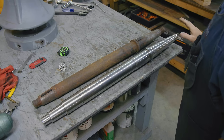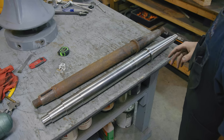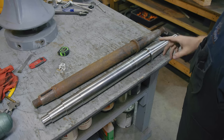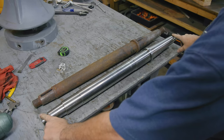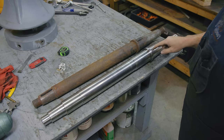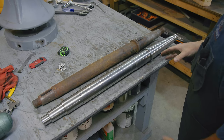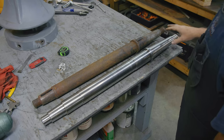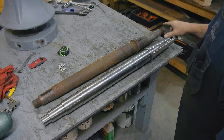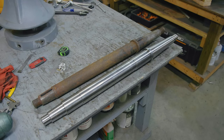Here are the two shafts next to one another - the new shaft and the old shaft. I think it's going to work. So what's still left to do: we've got to thread both ends, we've got to cut a key slot here and a key slot down at the bottom. And I think we're done. But for this video, which was focusing on the tapers, we're going to call it quits here. We're going to come back and do the threading and milling to finish this thing up in the next video. But it's coming along nicely - really, really turning out nice.